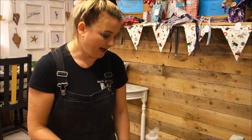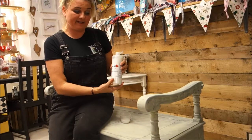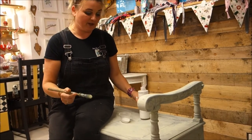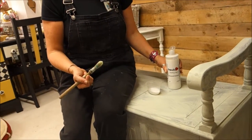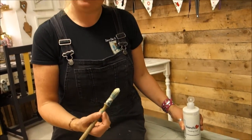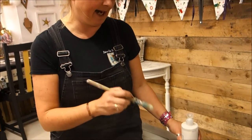At this stage I know this is going to be a problem, and that's just from years of practising and trialling and erroring. So today, to fix this problem, because I know this is going to continue to be a light piece of furniture, we're going to use this amazing stuff called Frenchic Finishing Coat. You can use other products — I've used shellac in the past, which works, but it smells disgusting, it's bright yellow, takes hours to dry, and if it isn't completely dry, painting over it gets all lumpy and bumpy. This stuff does none of those things.